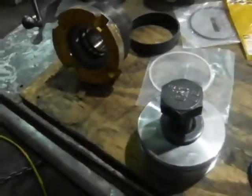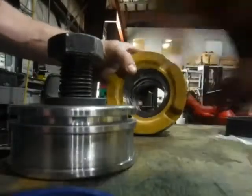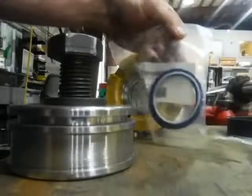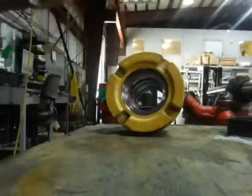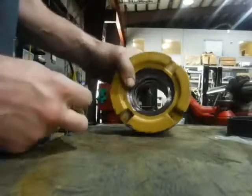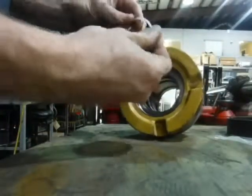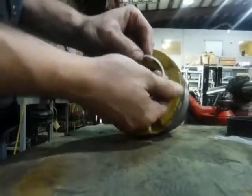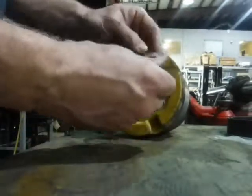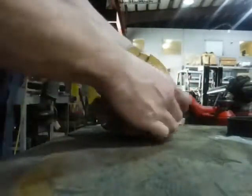I'll install the seals. The buffer goes in this — this is the furthest groove. Watch on these: one side is rounded off and the other side is flat. You're going to put the rounded off side towards the seal and the flat side towards the front of the groove. If you accidentally break this when you're putting it in, as long as the piece doesn't break off, you're fine.